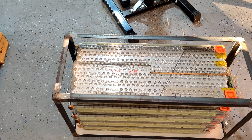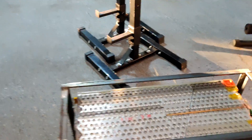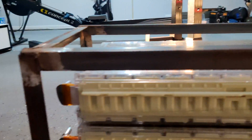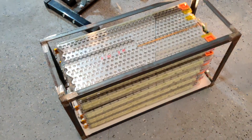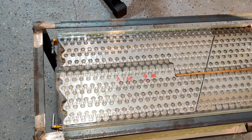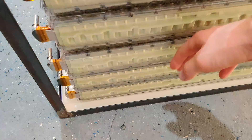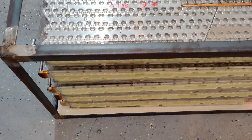I've got five modules stacked up here in the front battery box to prove that they'll fit. The clearances are tighter than in the rear battery box, which is what I anticipated when I cut these steel angles and welded the box together, because the space up under the hood is also a tighter fit. But it looks like they'll fit just fine. Keep in mind that this whole box is going to be rotated so it's sitting on its side, with the plastic pieces of each module facing down instead of facing outwards.